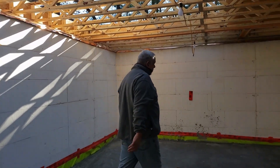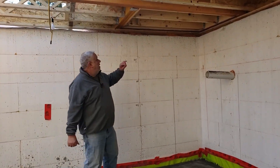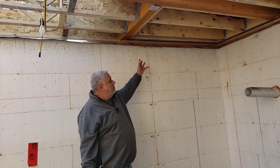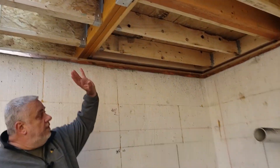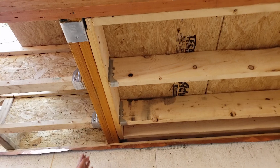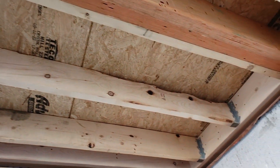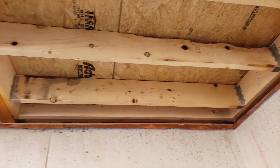One last thing we can see over here — you saw it in one of our other videos — but this is basically the bottom framing of that shower pan. So we have a curbless shower there. We frame it out like you were framing out an opening with the LVLs, and then basically it gets infilled with a two by eight frame.